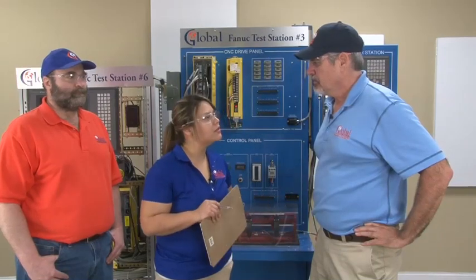John, a customer reported noise in the spindle — they rebuilt their gearbox but are still getting the noise. Irwin, any ideas? Usually there is a gear on the back of the motor with a hall effect sensor that senses the speed; when that is going bad, it will sound like your motor is full of rocks.